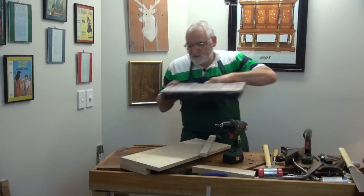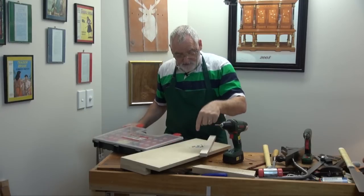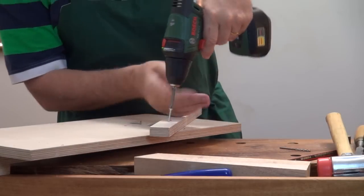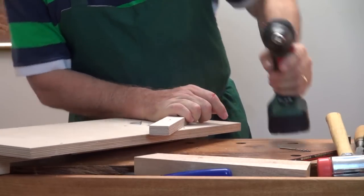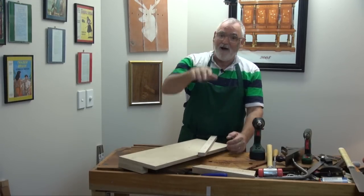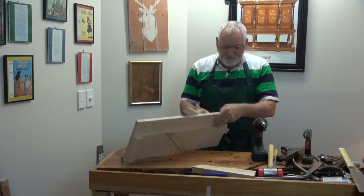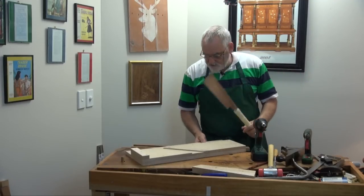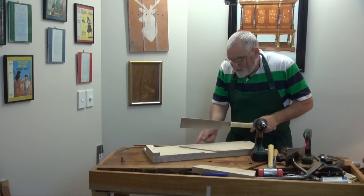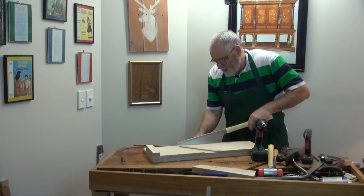Now, where's the screws? Same thing — 30x8s. Because the last thing you want is a screw coming through here and damaging the cheek of your plane. I said Bosch don't sponsor me, but if anyone from Bosch is watching, I'm open to suggestions. That's going to sit where I want it. Japanese saw again — I'm just going to cut these off, a little bit wider. I don't want it exactly parallel or flush with this. I want it a little bit fatter and I'll take the rest off with a plane later.